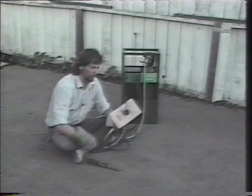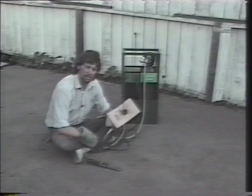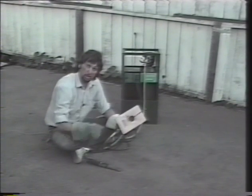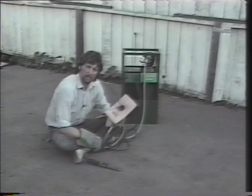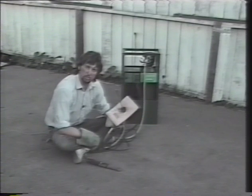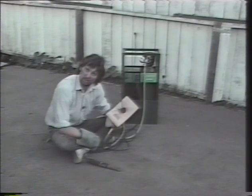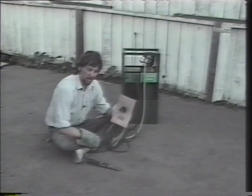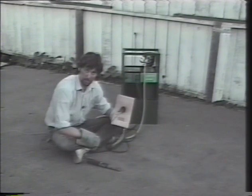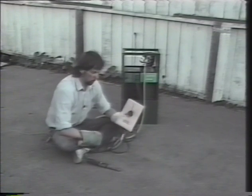Rod lasts about 30 to 40 seconds, then you change rods. You can adjust the flow of the oxygen by adjusting the pounds per square inch. You get a hotter, more direct flame. For concrete, rocks, bricks, 40 to 50 pounds per square inch. For simple things like safes, hard plate, and steel, 10 to 20 pounds per square inch goes through it like a knife through butter. A couple of interesting things about this torch.